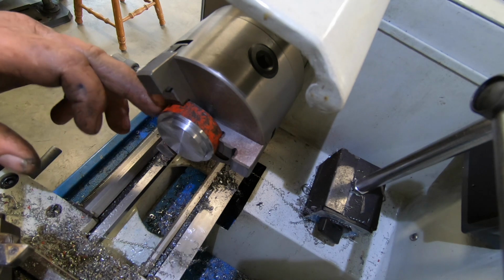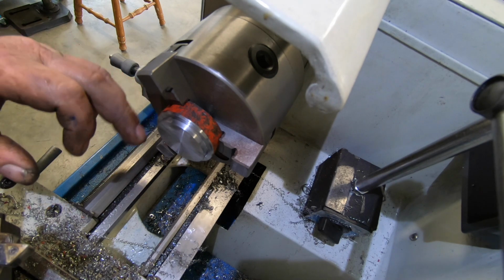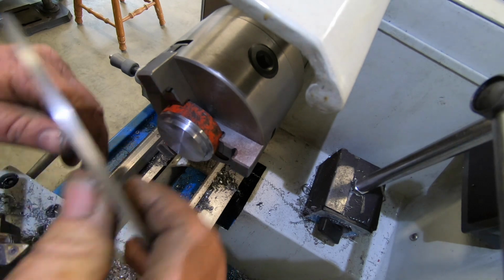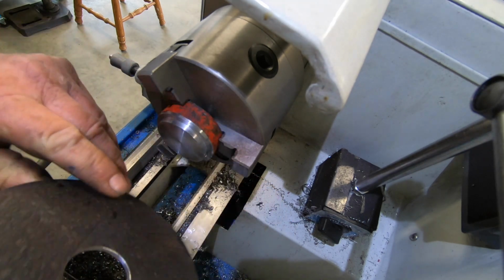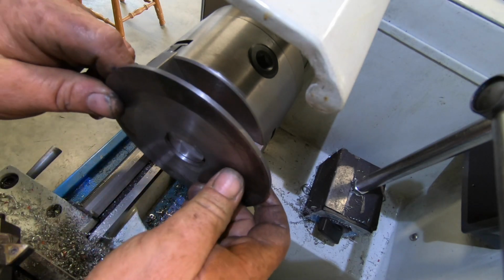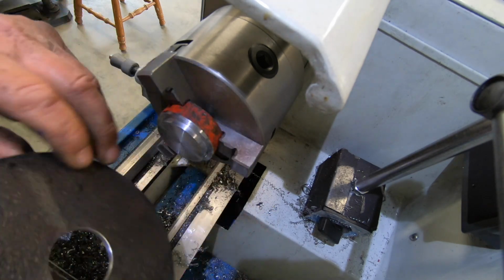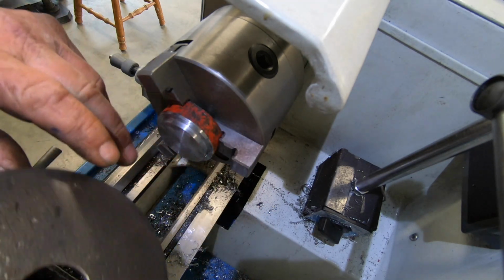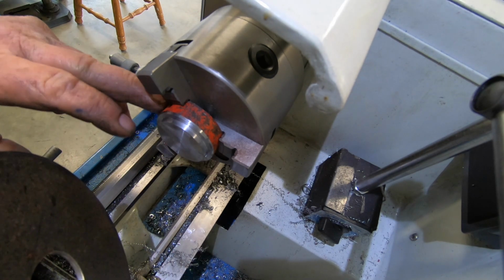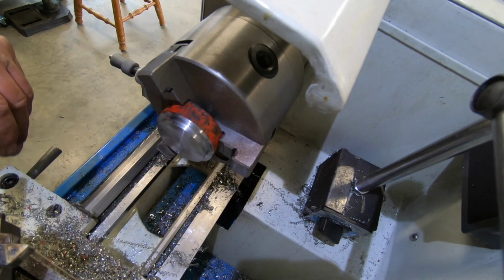This will go behind the brake or the locking system, spindle lock. And then when you do the nut up on the end of the spindle, it'll squeeze up onto this plate. And I'm probably going to have a dowel in it as well, so that it'll locate and not be able to turn. So I'm just going to machine this down 1.25 inches, and then spin it around, then clean the other side up and reduce the size a little bit as well. And then I'll bring this back when I get a bit more further advanced.